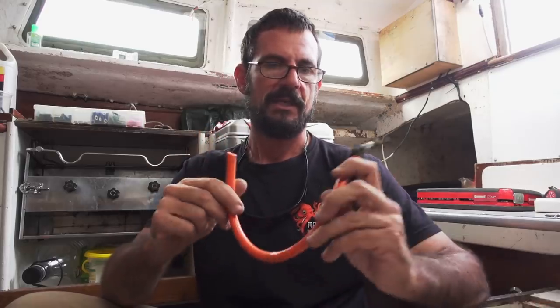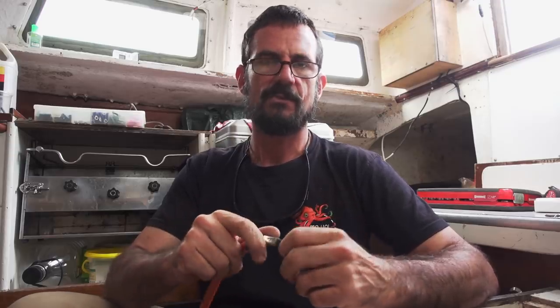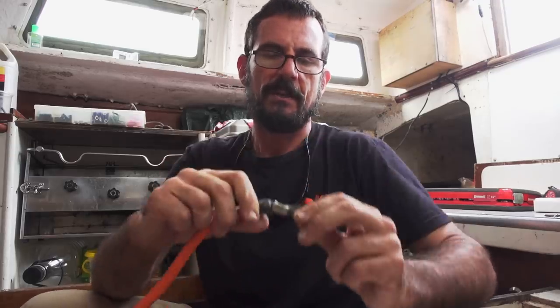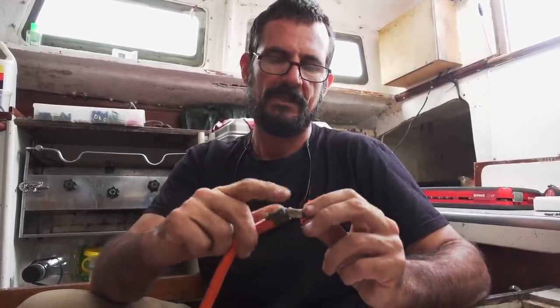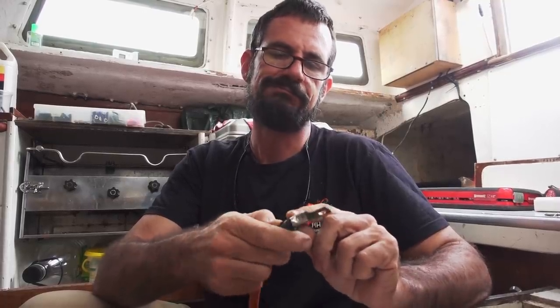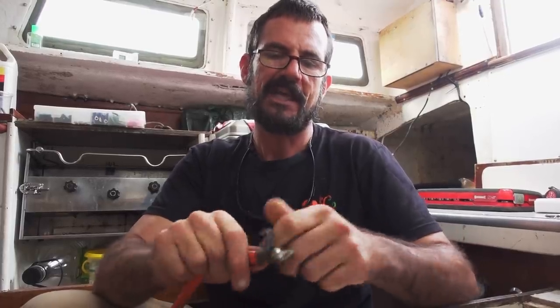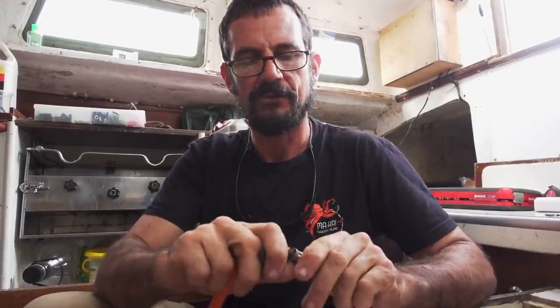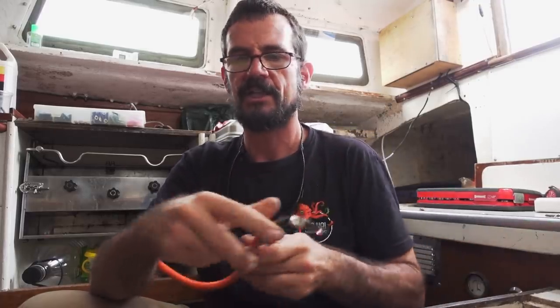The banks are made up of six-volt batteries — two lots of six-volt in series to get 12 volt, and then those pairs are paralleled. The cables are a bit long, and also last time they were done — this is quite common on boats — when people are making up the cables they might not necessarily have the best equipment. With this one, some self-amalgamating tape has been used, but because it wasn't a very good crimp, you don't have great contact there and some of the strands might spread.